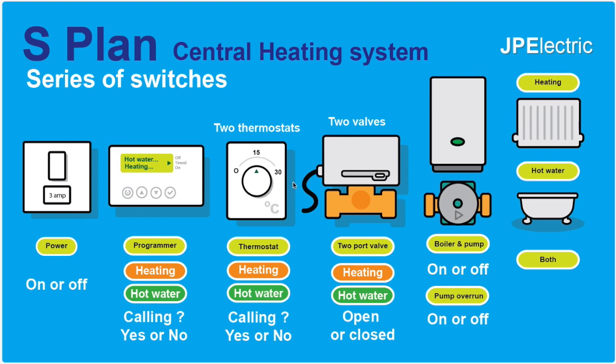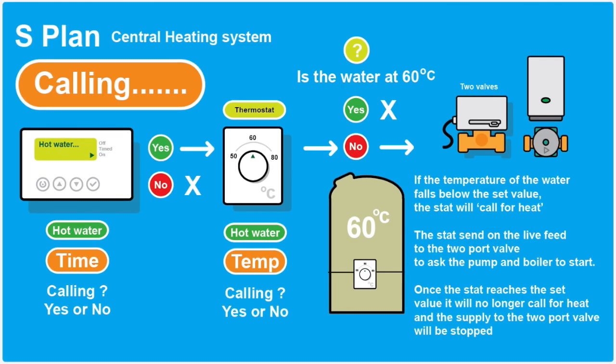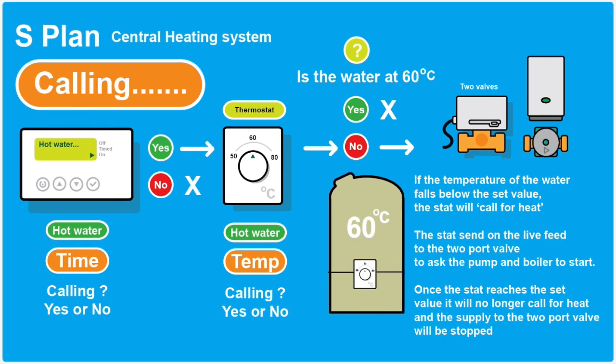All these various elements are there just to switch the boiler on or off. We don't want to be waiting for the hot water to heat up — we want it there when we need it. So we have a tank, a storage of hot water, and these controls enable this tank to remain warm so we've got hot water when we need it. We don't want the boiler constantly firing up and heating the water — that would be a waste of energy and resources. So this is why we have it controlled.